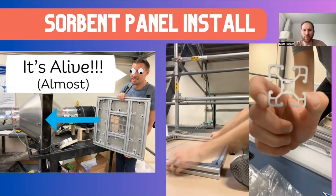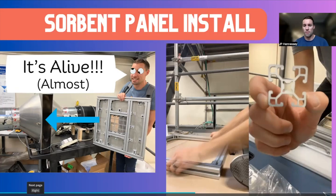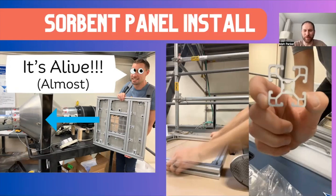The original filter was a standard furnace filter — they bought the duct piece for the outside to make a custom piece. The important thing with these systems is that you don't want air flowing over or finding gaps so it bypasses the sorbent. You have to tape, gasket, or caulk it to force all the air through the sorbent and get maximum CO2 exposure — otherwise you're not capturing the CO2.